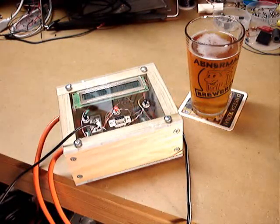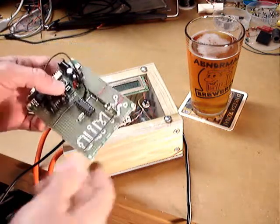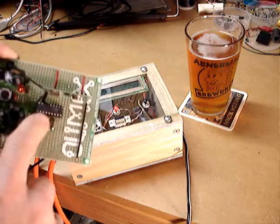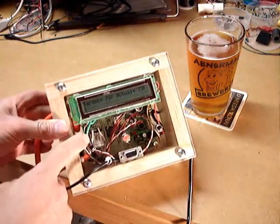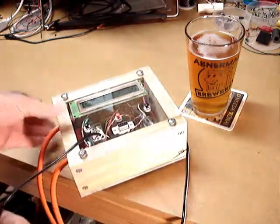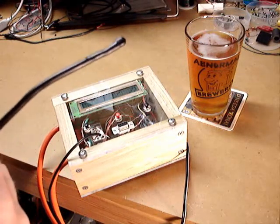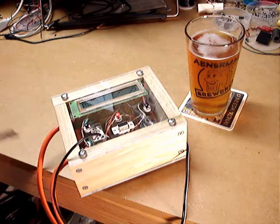For those of you who perhaps didn't see my first video where I was prototyping this on a prototyping circuit, this is what the board inside the case looks like — this has some additional stuff on it, but this is basically what the prototyping board looks like. This board contains a microprocessor, and inside you can see there is a relay. Also coming out of this box is a temperature probe which is attached to the board inside, and at the other end of this wire is a little chip known as the LM34.